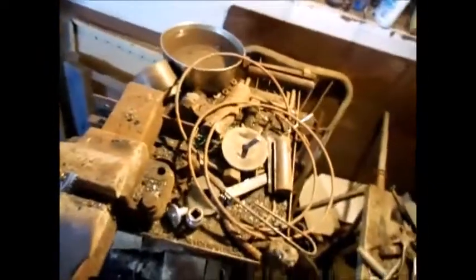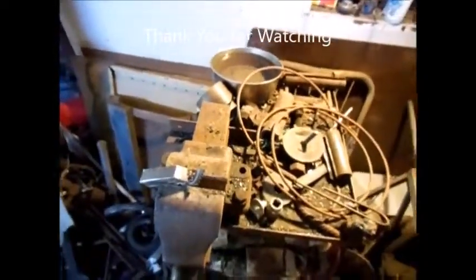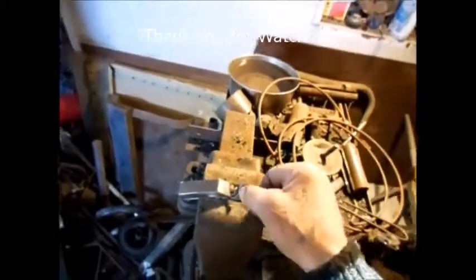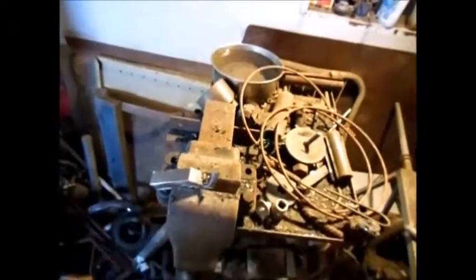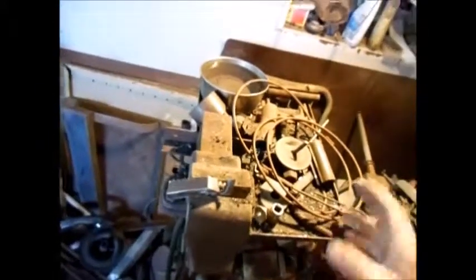This is it. Still hot — need to wait a little time to cool it down. It is not good to cool it straight into water because sometimes when you weld high carbon material or high speed steel it could crack near where the weld is. Therefore it just needs to be cooled down slowly and naturally, without using any extra cooling.